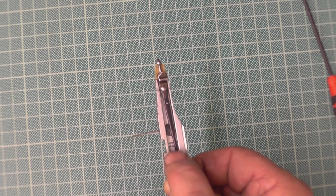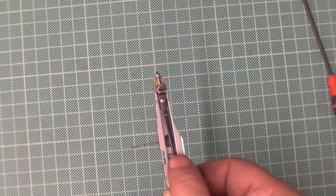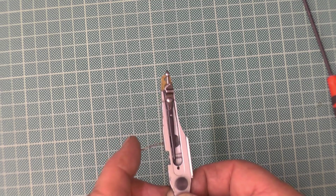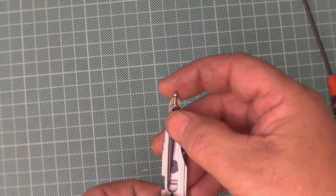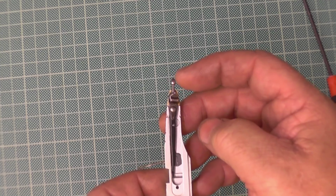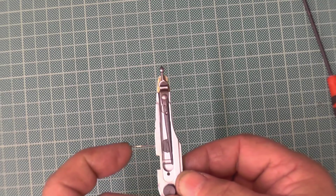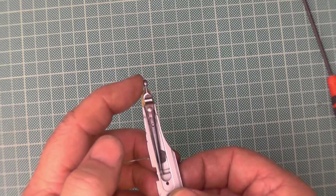Now on this end, which I'll show you on another DTI, there's a helix or a screw, which is what moves the hand backwards and forwards. For the stylus to work one way, for example if I've got it up the top, it will work from back to front, that way. This is the front up here, that's where the dial should go. Now if I turn that so the lever's pointed down over, it works from front to back, that way.